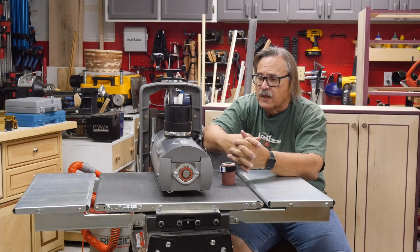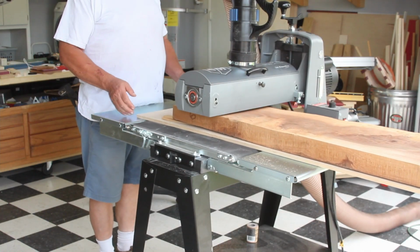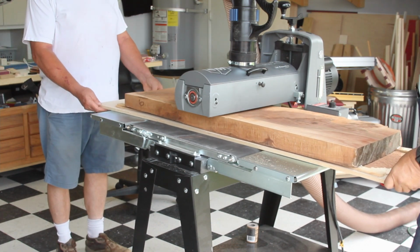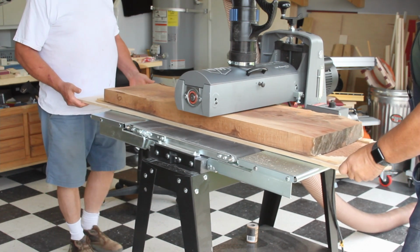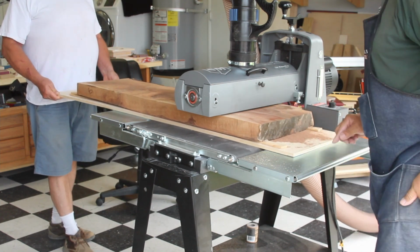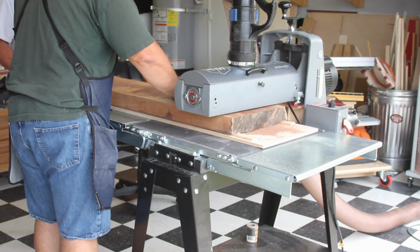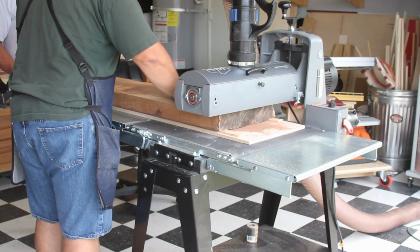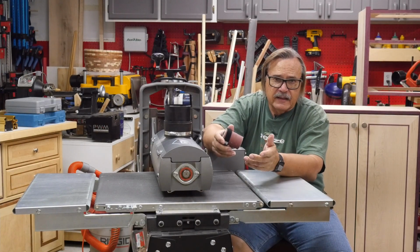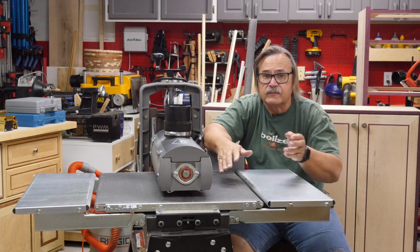A friend of mine had a large table he was making, and he had a really thick slab of wood that we needed to square up. So we attached it onto a flat piece of board because it wobbled a little bit, so we made some adjustments and shimmed it up so that it stayed level. And we were able to use this to flatten one side, and then once we had one side flattened, we could flip it on over and go through. And for that we used, I think, 60 grit, and then we went down to 80 and then 120. So it went relatively quick.